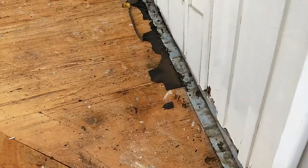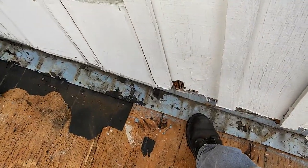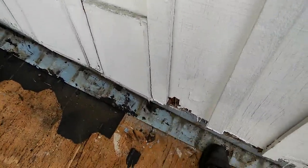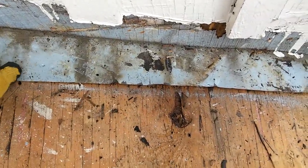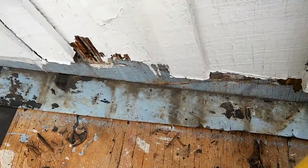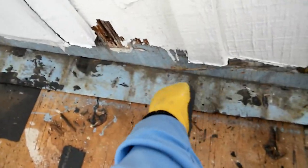Right here they used tin shingles behind the 1x4. They could have just removed the 1x4 and used this L metal that's buried to the wall. Just clean it right and then pack it. We just put a lot of mastic and then use it as tin shingles. I have no choice — I cannot use tin shingles here. So know when to use tin shingles.